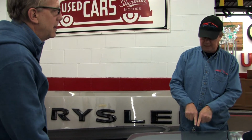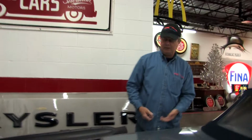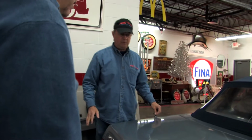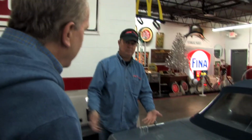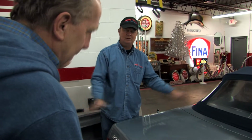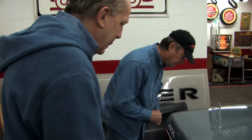So it's going to open it up? Yeah, make it worse. When the top coat goes on there, the chemicals can go in them little cracks, and then it could curl up while you wetted it down, or as it dries, when the surface gets tight, it could pull them apart. It could lay on top of them, but it's still underneath it. So it's like pouring concrete on top of mud. Eventually it's going to break. This was the top coat done 30 years ago. Yeah, so it was just air dry stuff.